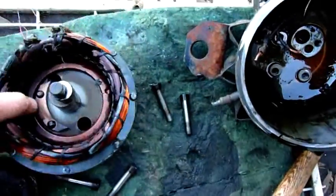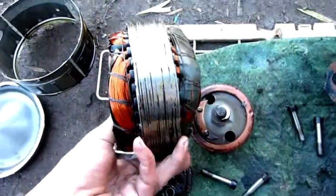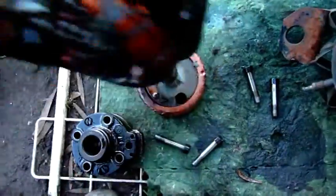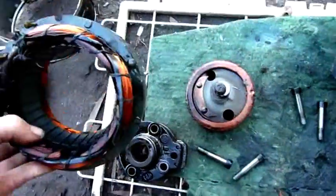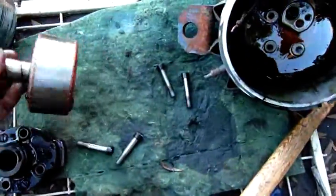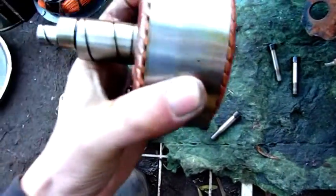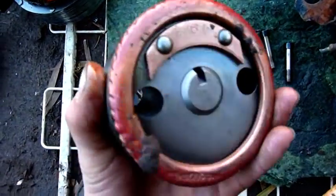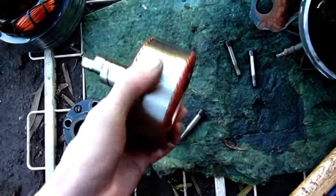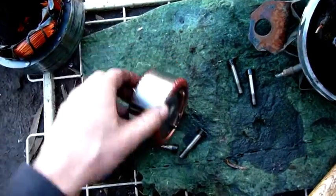She's toast. Interesting laminations — very crude, just made out of scrap offcuts, not even very well soldered. It's one very crude stator but a neat little rotor. Make a good paperweight. It's got copper laminated through it instead of aluminium — a lot of rotors these days are alloy. They have aluminum pressed or cast through the laminations to create magnetic poles.